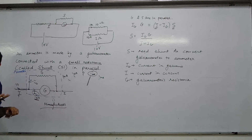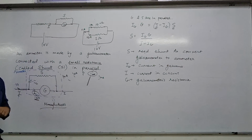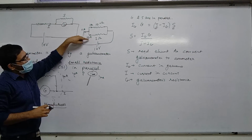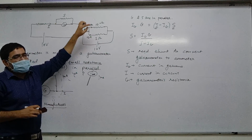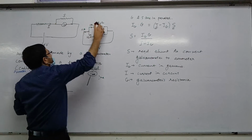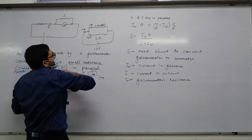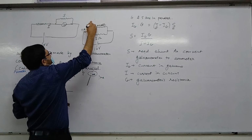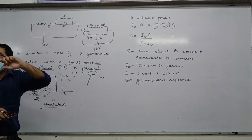Did you get the answer to your question? Total current is 11 ampere. Yes or no? But out of that, most of the current, that is out of 11, 10 ampere will pass through the 1 ohm. Clear or not? And only 1 ampere will pass through the 10 ohm. If it is 100 ohm, this is going to be 10 ampere and this is going to be 0.1 ampere. Yes or no? Most of the current will pass through the smaller resistance.